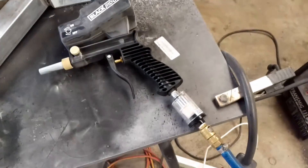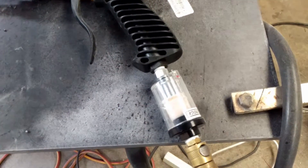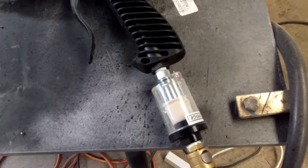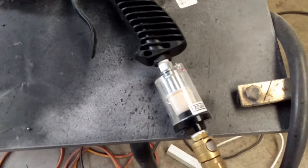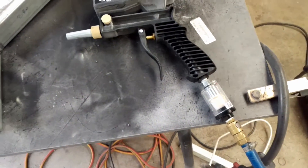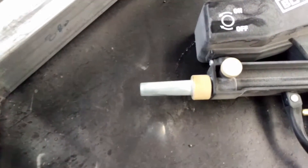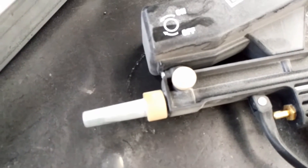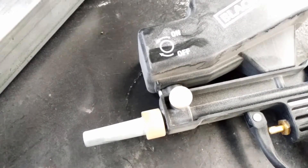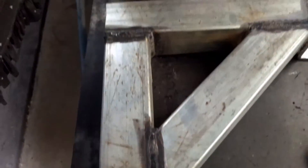So I bought this. I have a bit of experience with sandblasting from working on Land Rovers. I used to use bicarbonate soda because it's soft on aluminium. There's a little water filter here to catch all the moisture. I've had a crack at it with the bicarbonate soda, and I've got garnet as well which I'll try. It seems to do a good job, the soda, so we'll see what happens.